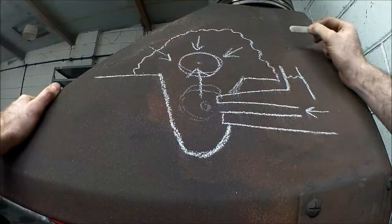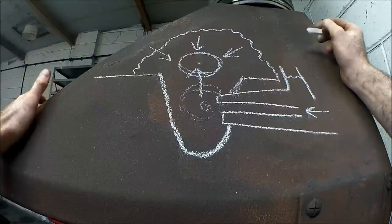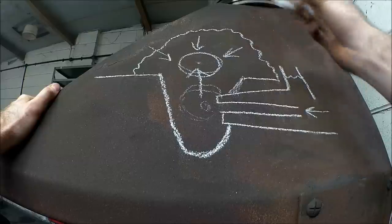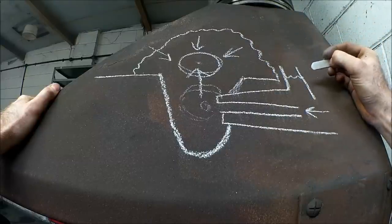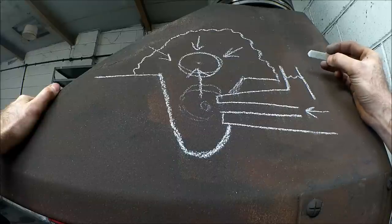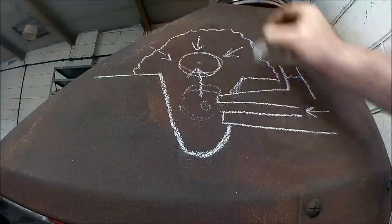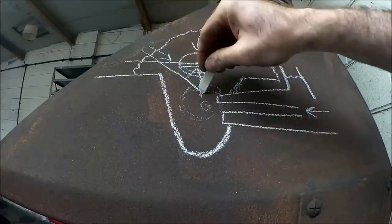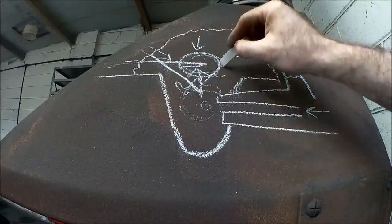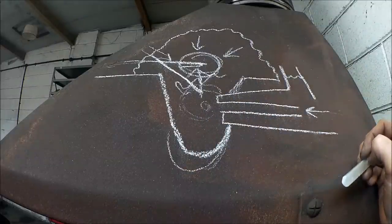That's why I do not use flux — and thinking about it, they didn't use flux many years ago. They hadn't got all the ingredients we have today. They've been fire welding for 5,000 years and may have used silica sand if they could get hold of it, but generally you don't need to, as I've demonstrated with mild steel. Certainly you can get to higher temperatures with pure iron and wrought iron without burning, because they don't have a carbon content. Steel comes here into the nucleus — not too deep into the air blast — it will burn. You're controlling the heat in this nucleus with a nice insulated fire, controlled oxygen, and a rubbish trap.